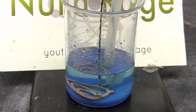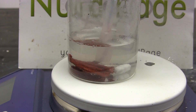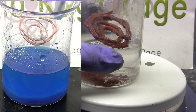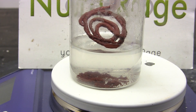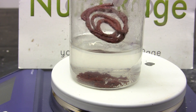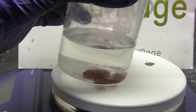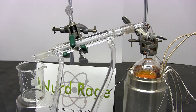In my particular run I had to electrolyze for about four days, so I'm going to skip ahead. I also had to stir the solution on the second day since the copper sulfate wasn't dissolving fast enough. Here we are four days later after the solution has gone completely clear. Lifting out the electrodes, we can see the copper wire is much thicker than it was originally, due to the copper plating out onto it. This copper is essentially the copper that originally came off the printed circuit board during etching — it all ended up here. The brown powder in the bottom of the beaker is copper metal that fell off the cathode; you can filter it off and recover it. The solution is sulfuric acid in water, which you can purify by distillation or use in future electrolysis runs.